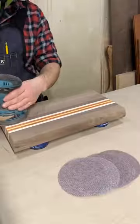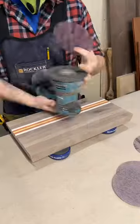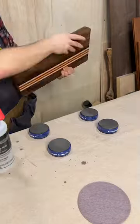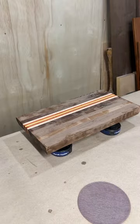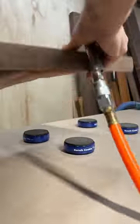After putting on my PPE, I get out the Rockler bench cookies to hold the board in place while I sand. I start at 80 grit to remove the drum sander lines, then move on to 100, 120, 150, 180, and finish with 220. I water pop between the higher grits using sand net paper.